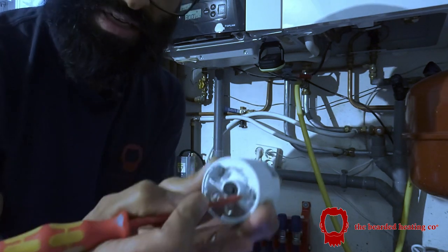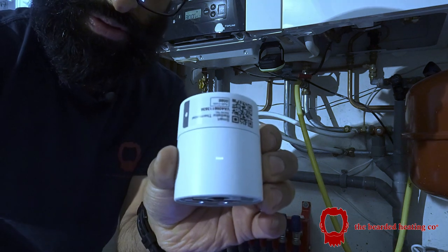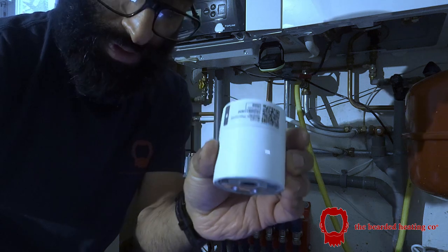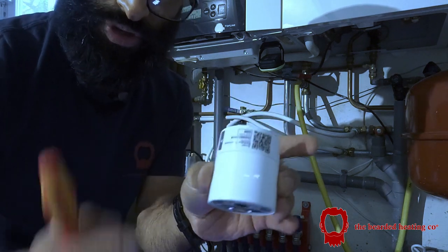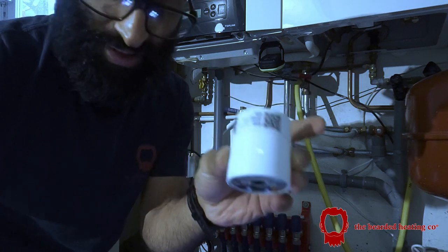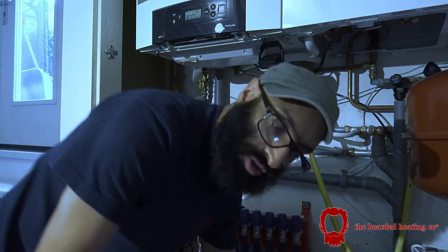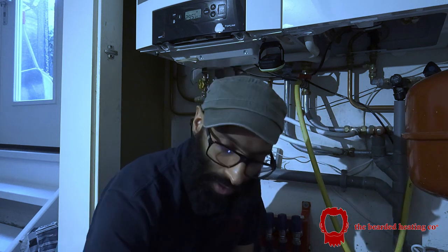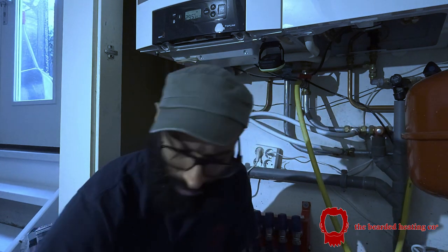Press the pairing button underneath, and then you get Knight Rider style three lights flashing across the head. This can take up to 2 minutes for it to connect to the bridge. Once this is connected, you follow the instructions and put the thermostat head onto each radiator. Obviously, this property has about 8 radiators, so it can be a bit long. That's just the name of the game and how the cookie crumbles. So you just have to be patient.